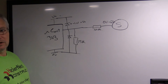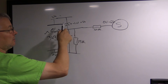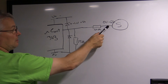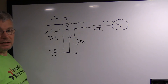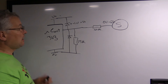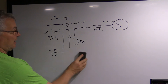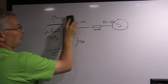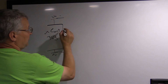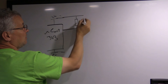That approach works well if you don't need isolation. But if you had a spike up here going to 100 or 200 volts with some energy behind it, those diodes are not going to help and you'll probably fry everything. So how do you get around that? For my electronic referee project, that's exactly what I wanted to address — so I wanted an extra level of isolation. The input now has a 10K pull-up resistor, so no matter what, it's pulled to a logic one.